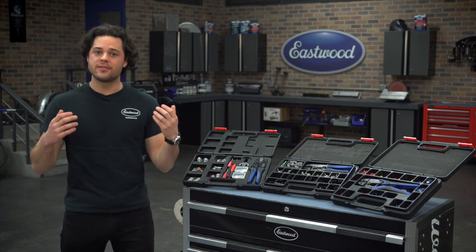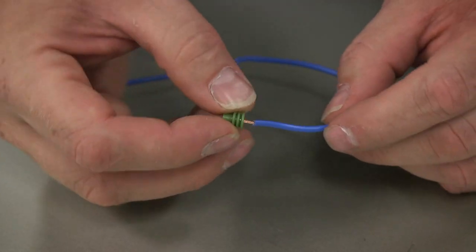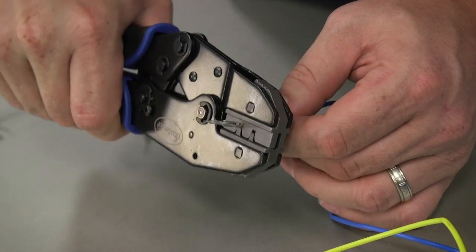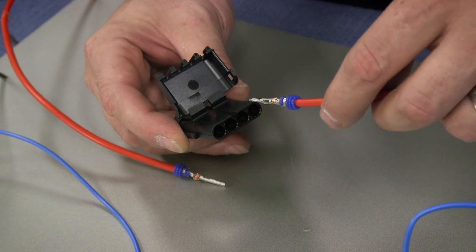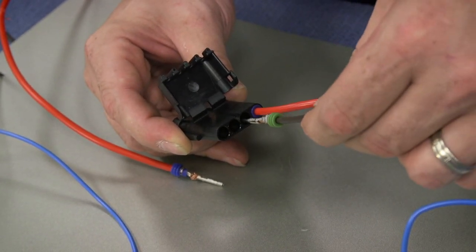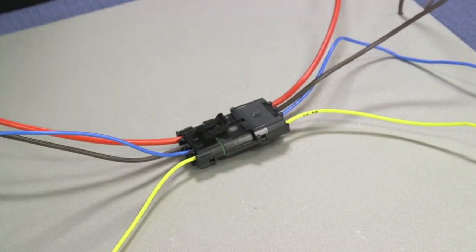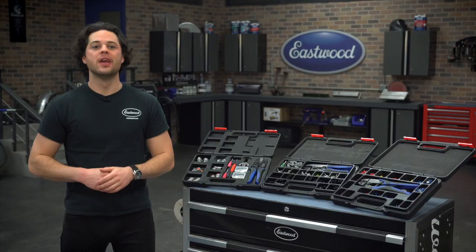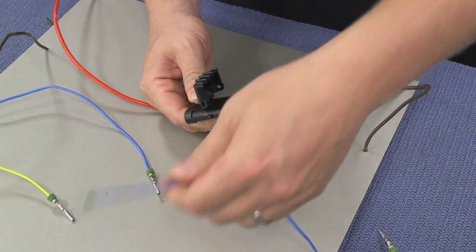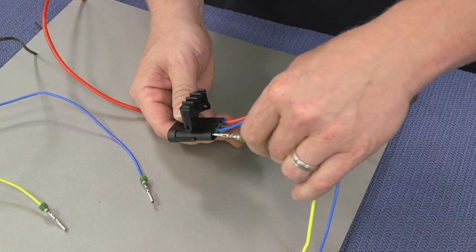Assembling these is pretty simple. First, you want to strip your wire, slide on the silicone sealing grommet, and then your pin, put it in the crimp tool, and send it home. After that, you can bring in a housing, and once you have the wire placed in the housing, you have a corrosion-free connection. There's also a seal in the quick disconnect itself to keep any weather out. Once you push your wire into the connection, keep going until you hear a click — that's the fins on the pins engaging with the connector, and once engaged, that won't allow them to back out.